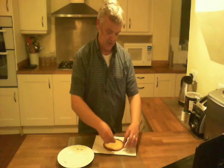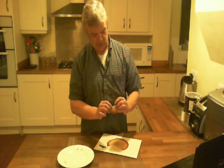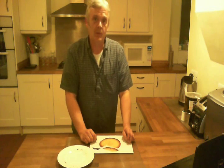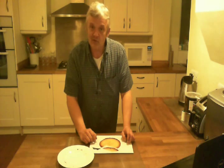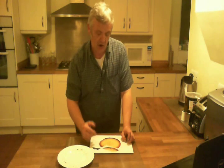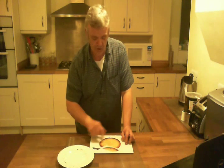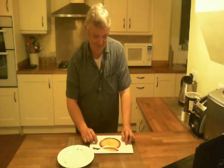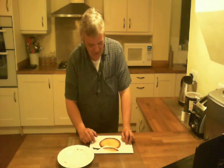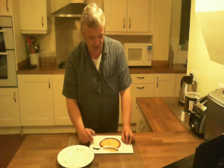And there it is — my solid gel electrolyte polymer film. I can cut that into whatever shape I want to form my battery separator. I've made this quite thick, about 2 millimetres, but it really needs to be in the region of 100 to 200 micrometres. When you cast it, just cast a thin sheet, let it dry, and then cut it. It's quite wet and has a high concentration of potassium hydroxide, but as you can see I'm poking it with my finger — it's much safer than a liquid and doesn't go anywhere.